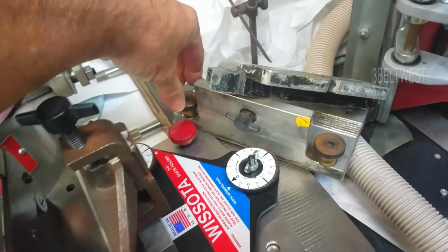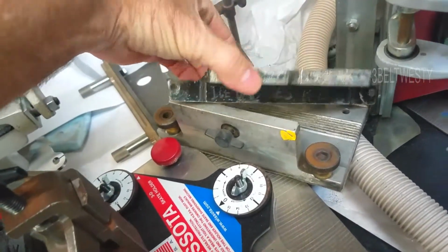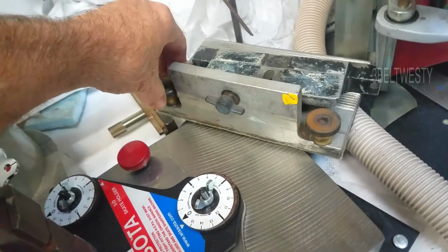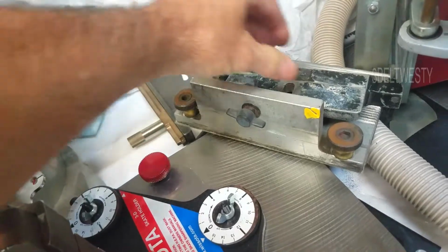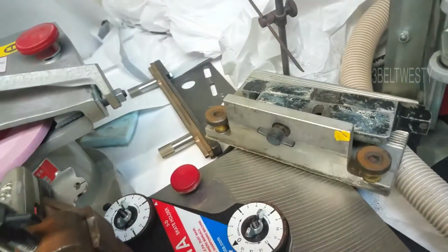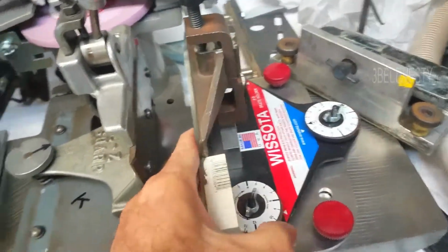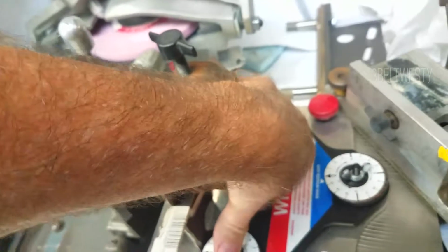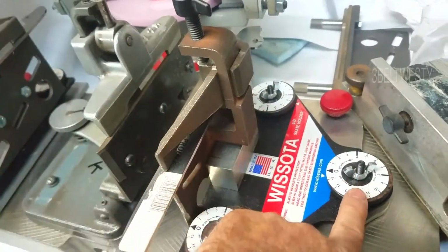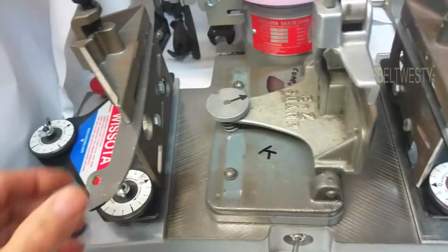This old holder here is one that was used. It says Ice Capades on it. It has a whole bunch of different holders made in Canada, and you turn these knobs and that lifts it up to adjust the plate up and down and sideways. That's just a vertical adjust. The 3D holder, of course, has two 1/4-28 screws that lift it up. And then you can use this either for tilt or bring all 3 of them to lift it up.